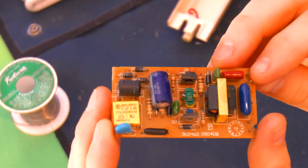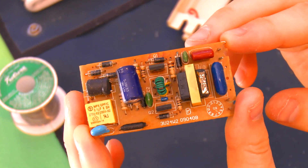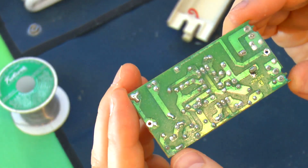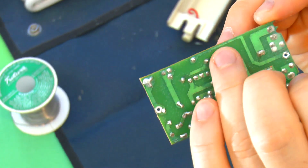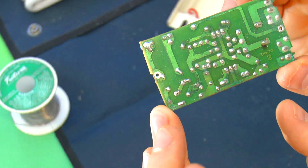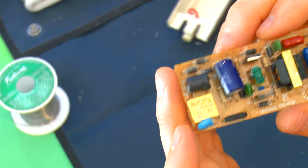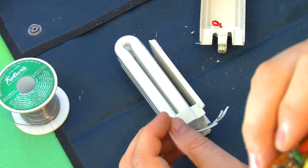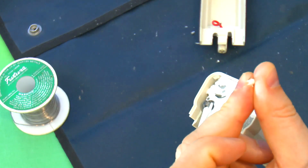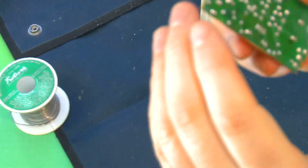Thinking about it, it's not quite as complex as I first thought — it's more complex than some of the cheap and nasty power supplies I've seen, in that this has actually got two transistors in it. Here's the back, and you can see there's some corrosion along here, which I think is on the surface more than anything else. What I'm going to do is resolder all of these connections. Those wire-wrap pins — I don't know why they were wire-wrapped. This does look a bit corroded, so I might struggle to get these soldered, but I will try.